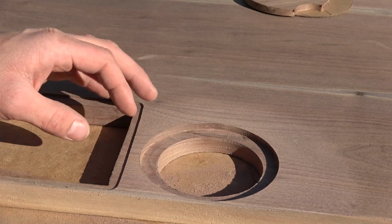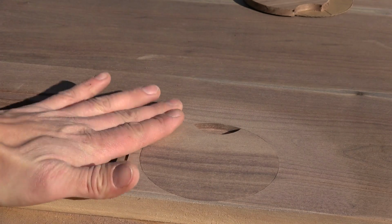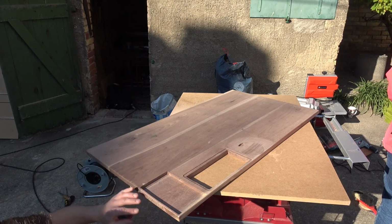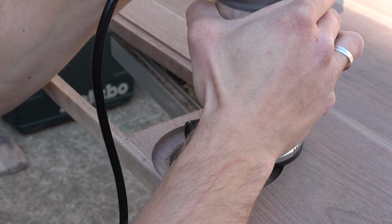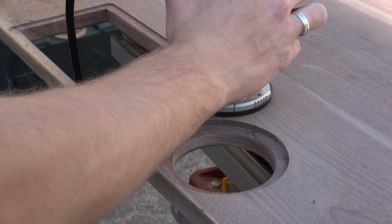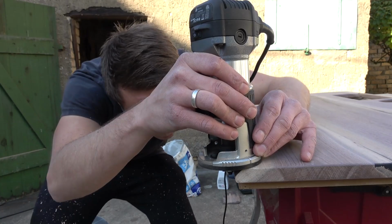This is gonna be so satisfying. The sound it makes. Awesome, looks so good. And all that's left were some finishing touches. With a 6mm radius round over bit, I managed to give the table and all inserts a refined look. And a 45 degree chamfer bit for the front side snuck really nicely into the live edge I left on the piece.